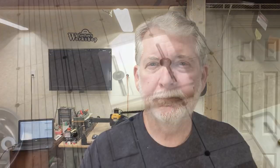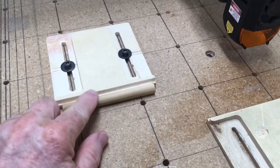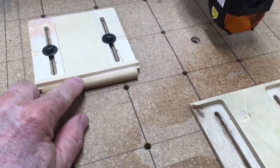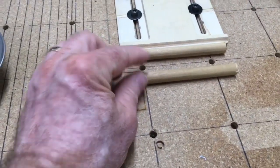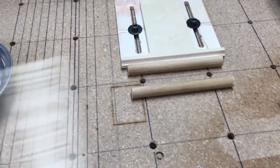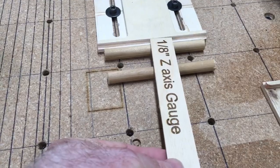I'm down in the shop today and this is just a real quick video to work on engraving on a 7/16th inch dowel rod, which is actually a little bit smaller diameter than a lot of the pens that I turn. But if it works, it's going to mean that I can personalize gifts for this Christmas. Now I'm going to set this up with a stop block because I don't want this moving. To set the height, I'm going to use a second dowel rod and use my little gauge to set the height of the laser to begin with.